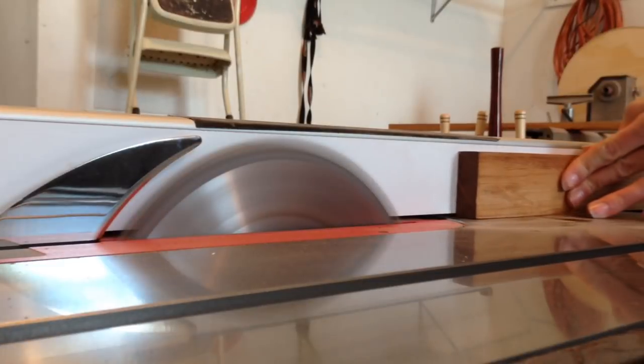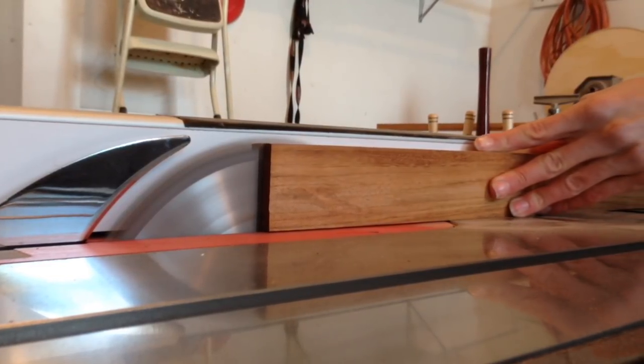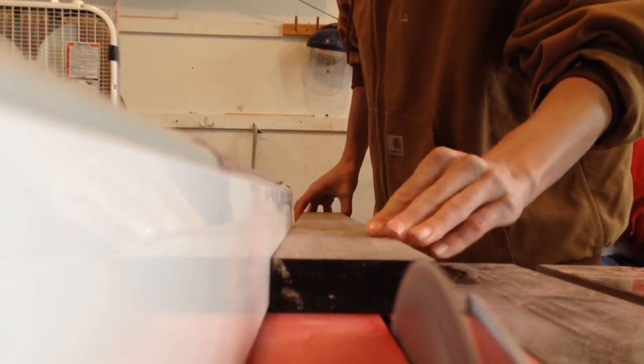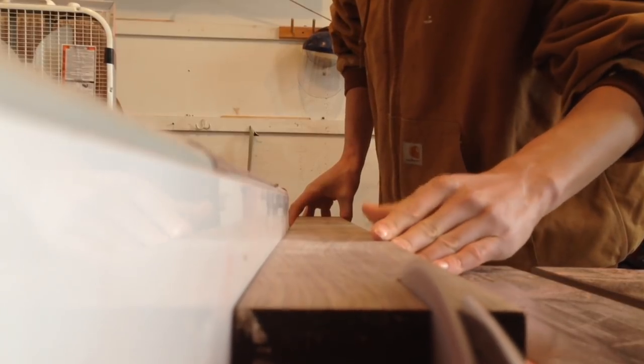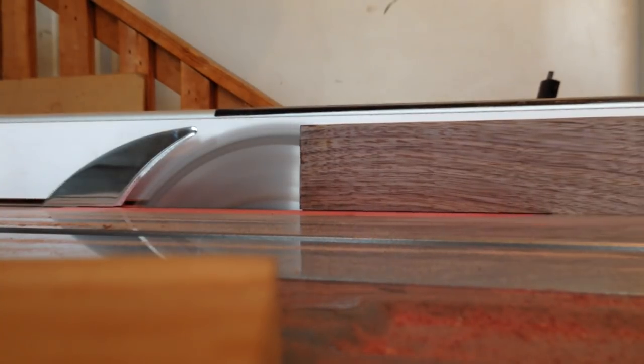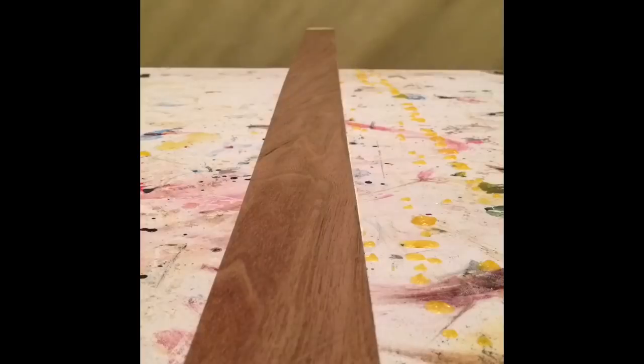With those rings flat I can move on to the ring with the chevron pattern. I have a nice piece of jatoba that I am going to use as the zig zag part. I want the zig zag pattern to be a quarter of an inch wide so I am resawing the jatoba to do that. Bordering the jatoba I want to have a walnut veneer going along it, so I am cutting that down to the width that I need and then resawing it to an eighth of an inch. I can laminate those three pieces of wood together going walnut, then jatoba, then more walnut on top.